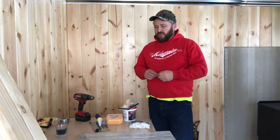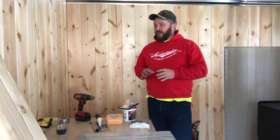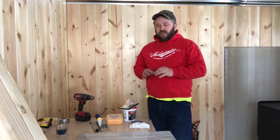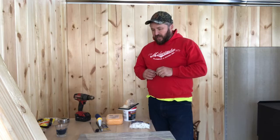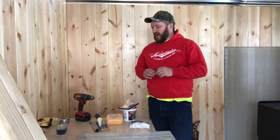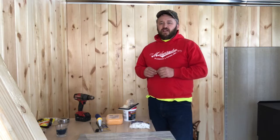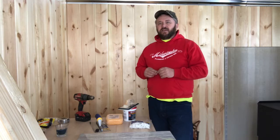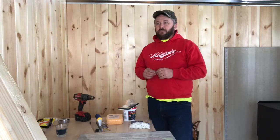The manufacturer of these tiles recommends that you keep a minimum of, I think it was a 1/8 inch gap in between the tile. I liked a little bit thicker gap that goes in between, so I'm going to be using these. And we'll go ahead and start getting the mortar mix now. And I guess I'll explain right in advance now the procedure that I'm going to use. Whenever you mix up your mortar mix, you kind of want it to have a consistency of maybe, I don't want to say peanut butter, a little bit soupier than peanut butter, but you want it to be pretty thick.